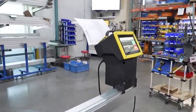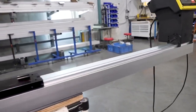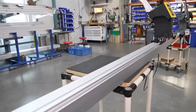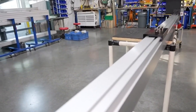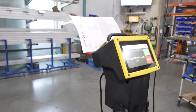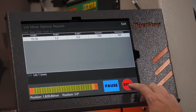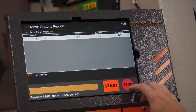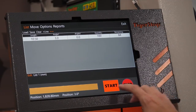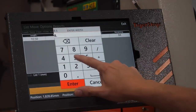After each machine is finished being assembled, it runs through a testing cycle. You can see here we've got a SawGear Touch, one of our newest products, running an auto-test — it'll sit here running back and forth for approximately an hour. That gives it time to do what we call a burn-in on the mechanics, making sure the glides all wear in and it doesn't need to be re-tightened. It also gives the production team time to check for any tight spots in the beam and confirm the machine is holding its accuracy before it ships to the customer.